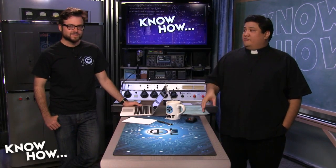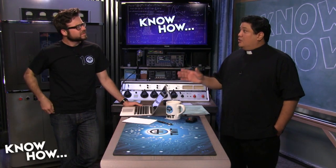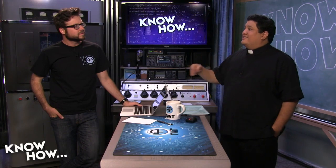Well, he actually had his own fix. The fix is you use high definition files. It was only happening when he had low def files because the bit rate was low enough to actually let the buffer empty out. If he was using HD, he was always pulling data off the drive. It would never stop. Okay, so it never took a break. It never took a break, and it stayed alive.